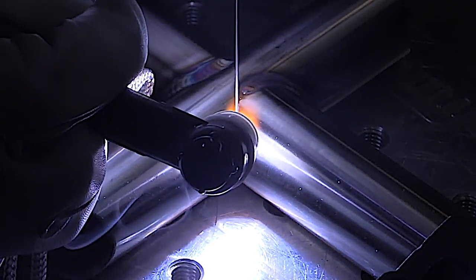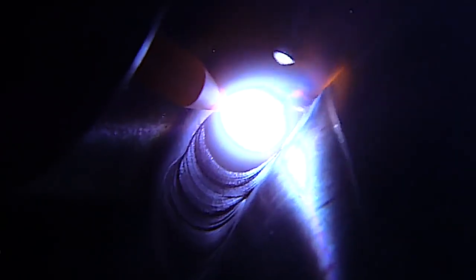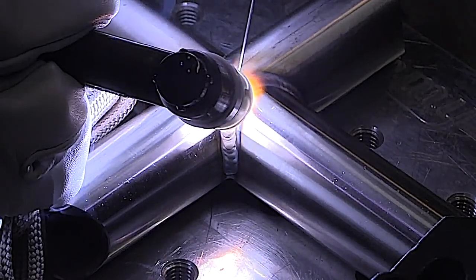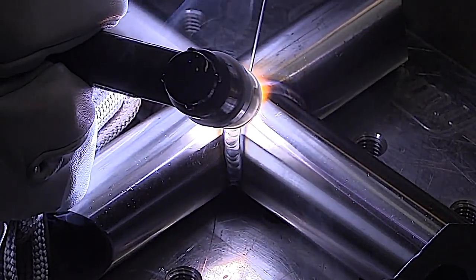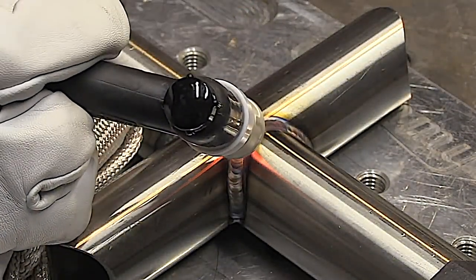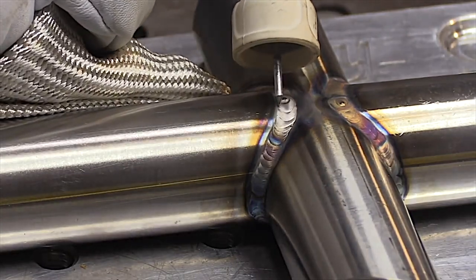The Jazzy 10 is also a great cup for stainless steel. With only about 20 CFH — which is about what I would use with a number eight cup — you can get really good coverage even while using about a three-quarter inch stick out. You don't always need to use that long of a stick out, but you can easily do that with this cup.